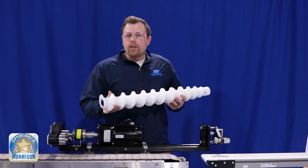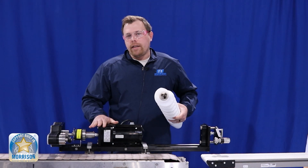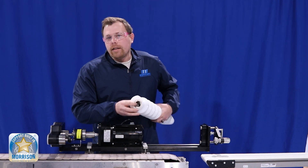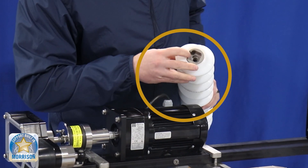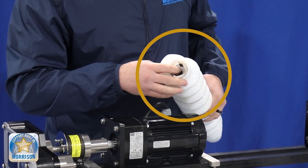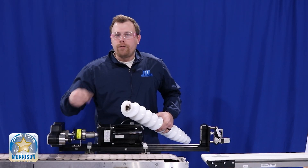The biggest keys to installing a timing screw — on our driven end, which we classify as the end that always has the motor on it, we will always have our square drive assembly. This is a keyed assembly that fits into a keyway that comes off of the drive assembly itself. You'll notice we have a square pattern and a keyway. The square pattern gives us four forces of contact to divide that rotational force evenly.